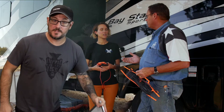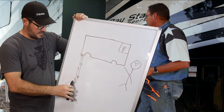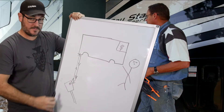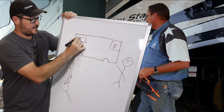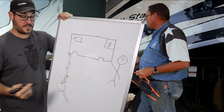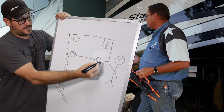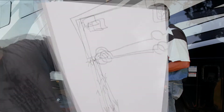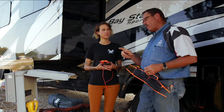Here's what's going on. You plug into a pedestal and that pedestal is delivering power to your RV — it's using it and it's going back. That's the flow of electric current. So say you hang a picture and you drive a nail through an electrical wire, jamming it into the frame — your RV frame becomes energized. Since it's sitting on rubber tires, the current can't escape until somebody touches a piece of metal connected to the frame, and then they get electrocuted.